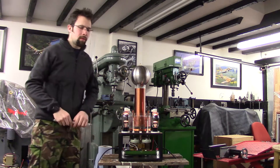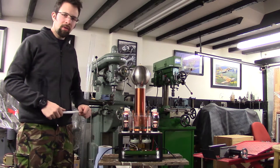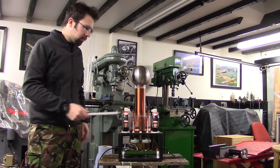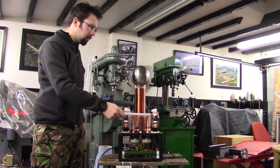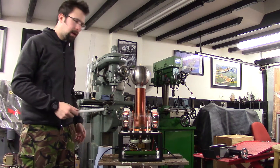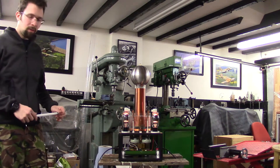We've got the Vosklok vacuum tube Tesla coil here. It's a Hartley oscillator, so it's using a feedback coil as you can see down the bottom here. It's using two 811 vacuum tubes — they are power triodes — and they are currently wired in parallel, but that may well change so stay tuned for that.